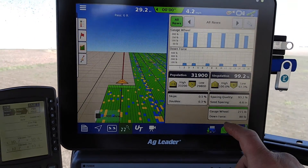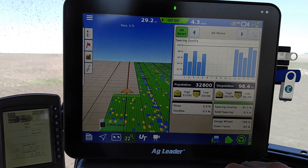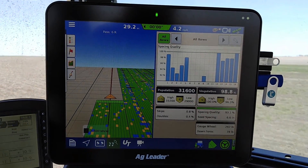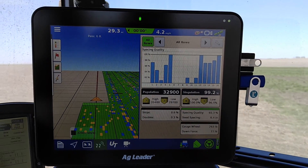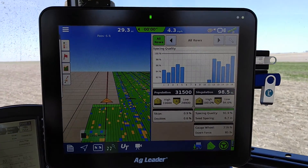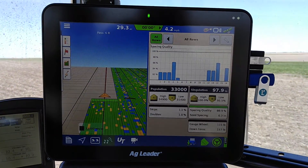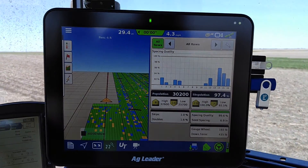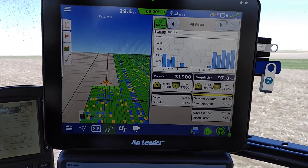I do have wave visions on this planter and I've noticed something interesting. Last year I didn't have them on; this year I put them on. My spacing quality on my inside middle runs — since there are six in the back on this particular planter — gets more vibration through the sprockets and chain linkage occurring there, and that results in poorer spacing quality. As of now there's not really anything I can do about it.